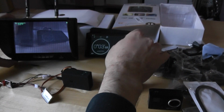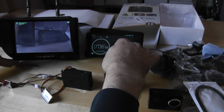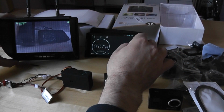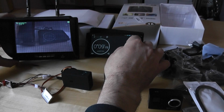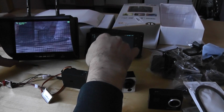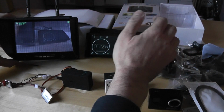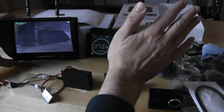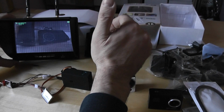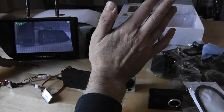You will see if you play and pause on YouTube that the latency, I guess, is something like 0.2, 0.3 seconds. Okay, so not amazing. You cannot really use it for FPV racing. You have something like 0.2, 0.3, but for a normal aerial photography platform at altitude, it's okay. It would be enough to fly FPV with this module, but for a racer, I assume not.